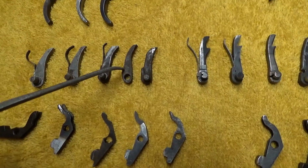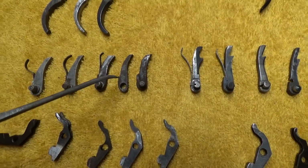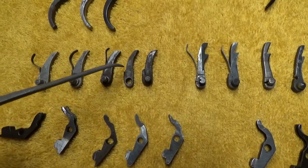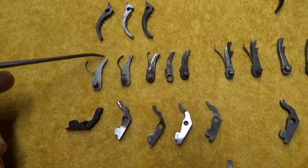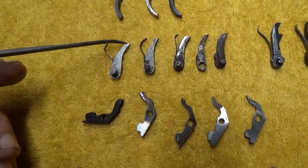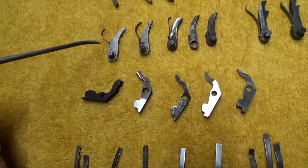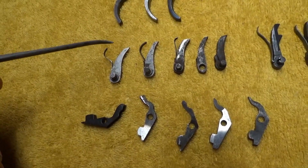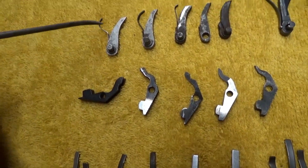And if you could get the spring just replaced in it, you've got your old hand that was working fine in the gun until the spring broke. So that'll go back to that situation. When that tip does wear a little bit, you're going to find that the bolt here will pop up just a little sooner in the cylinder, because we haven't rotated the cylinder enough yet when that bolt pops up.